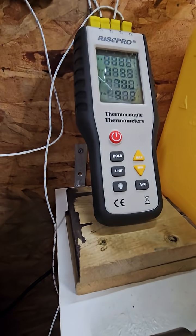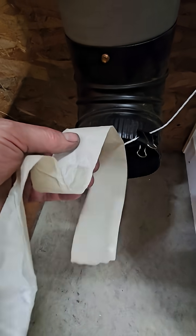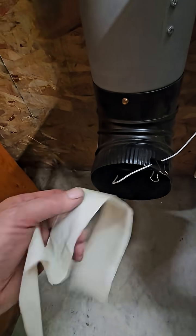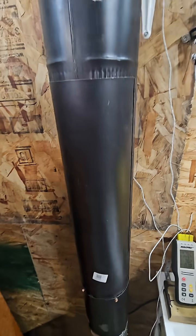So I'm taking that air, this volume of air here — 6 inch pipe blowing that hard and that fast. I'm heating that air up nearly 30 degrees and blowing it out at floor level to counteract the stratification of cold air at the floor and hot air at the ceiling. I'm pretty happy.